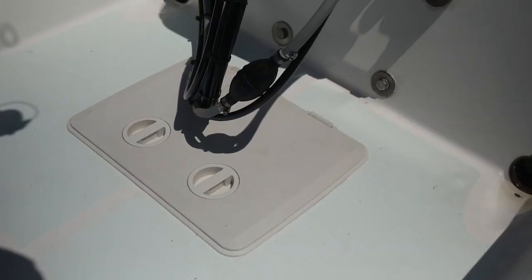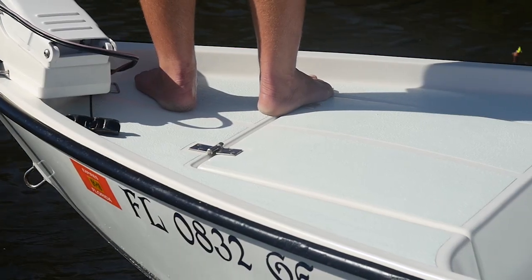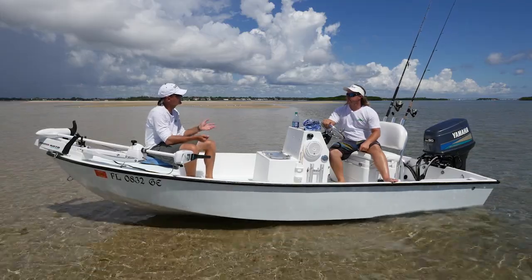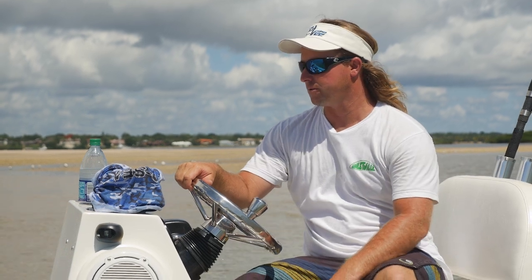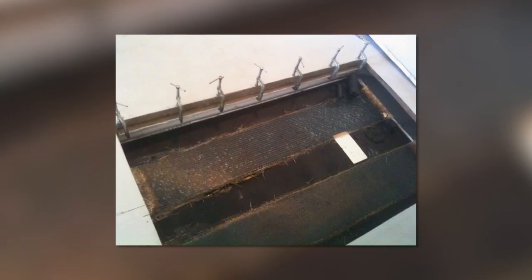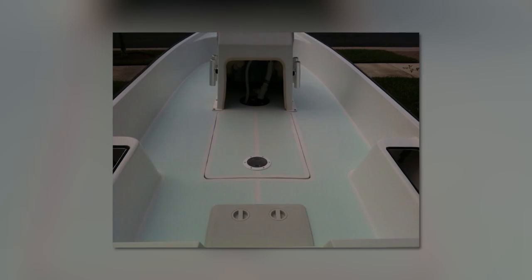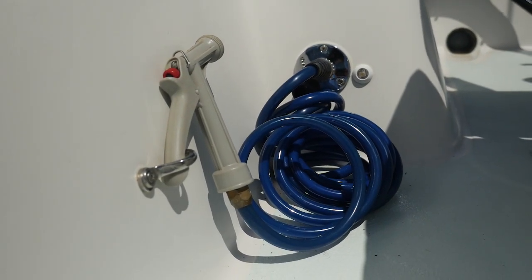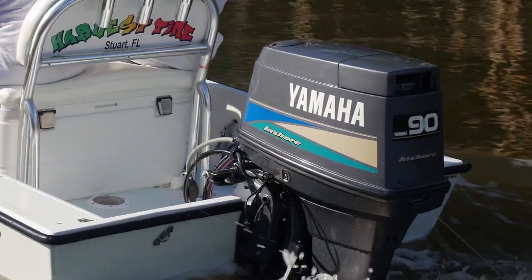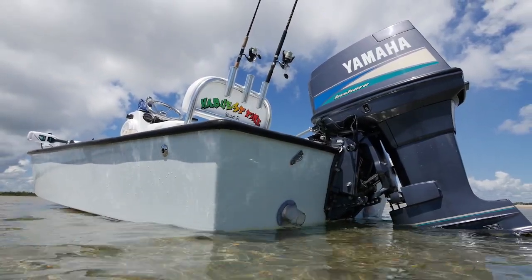The amount of non-skid you have in here is just from the roller, but it looks good. I added a little bit of grip additive — just enough to hold a grip on your foot but not hard to clean. This boat didn't originally come from the factory with a built-in fuel tank, but you installed one — bring me through that process. With any boat, space is a premium, so I wanted to get everything out of the way. I took a guess at where the stringers were, cut a hole, measured out, and put a below-deck tank in there, glassed the lip and put the lid back down. I also put a fresh water tank in while I was at it — I'm really glad I did. You went with 18 gallons? Yes. For a two-stroke motor that's good, because you're going to need a little more fuel — it's not as fuel efficient as a four-stroke, but the weight you saved by not going four-stroke kind of offsets it. The boat runs great. You barely have to give it any throttle and it's up and over fast. It's about one-to-one — 3,000 RPM is 30 miles an hour, 4,000 is 40 miles an hour. Get the boat to run square, that's all you can really ask for.